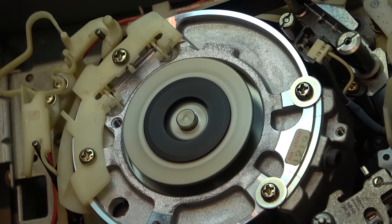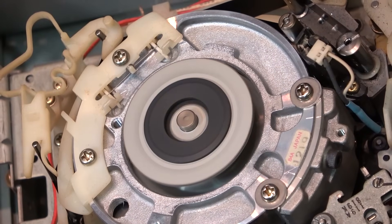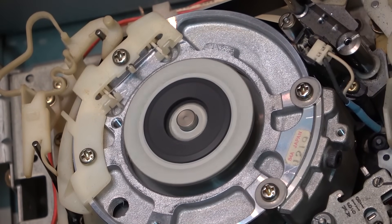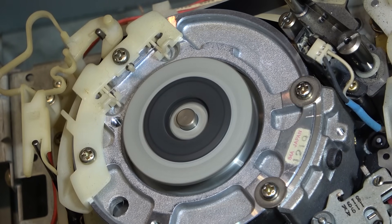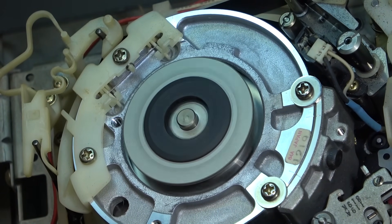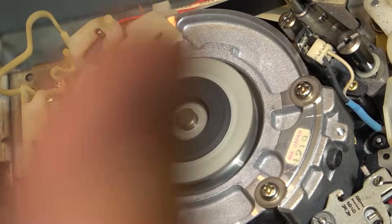You can still see it because the fluorescent light is still on, but if I turn the fluorescent light out, now you don't see it. That's the advantage of fluorescent light. These LEDs probably won't show the effect. Interesting — now we know where to look. Good thing I kept that old magnifier around; it's showing me exactly where to look. Even with the other lights on there's enough strobing effect. Now I know where to look — I'm going to be looking in the drum servo circuit.